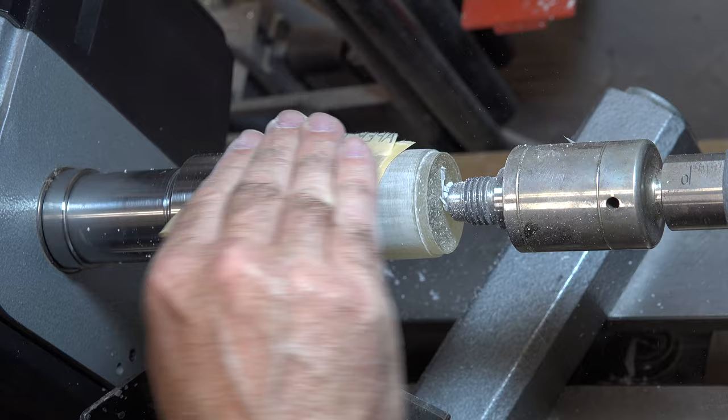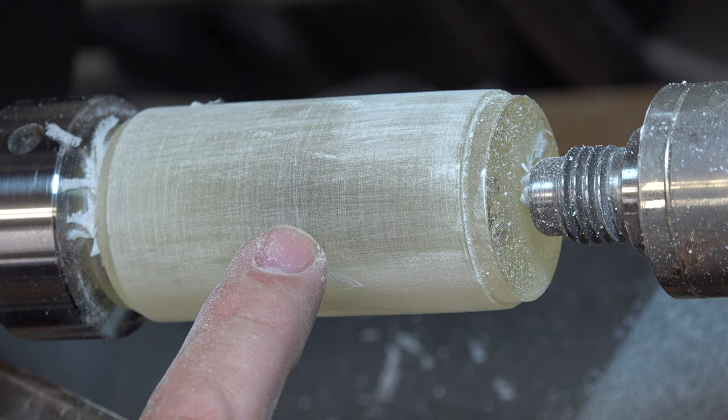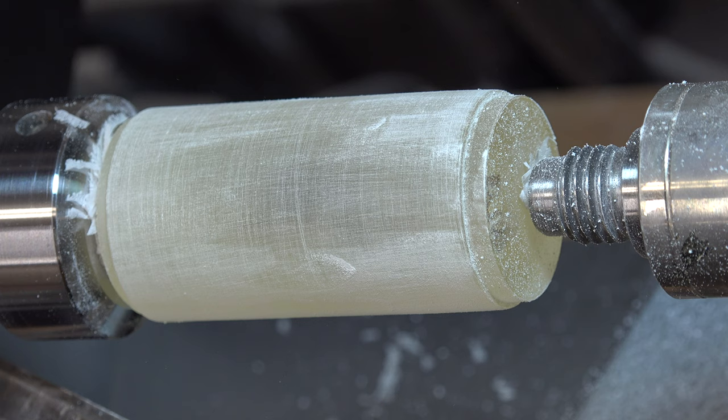When you're done, have a look at your turning — you'll be able to see distinct areas that need fixing. I can see a gouge line right here and a couple more over here. These areas really stick out when you sand in the opposite direction. I'll move through the grits quickly: finishing up 80, then 120, 150, 220, and for dry sanding I'll finish with 320 then 400.